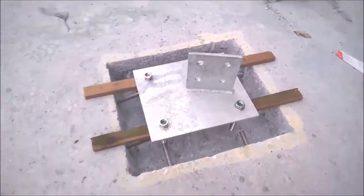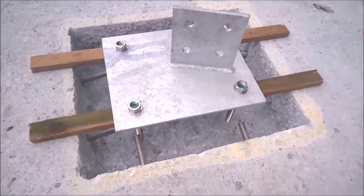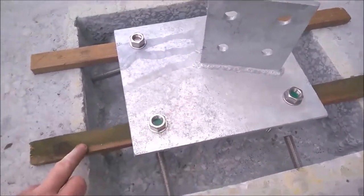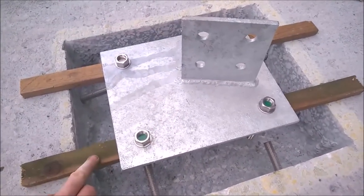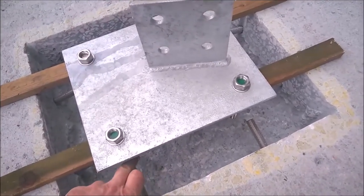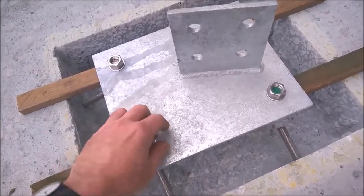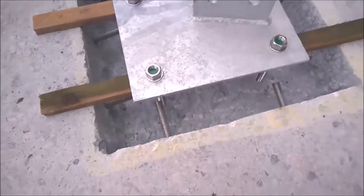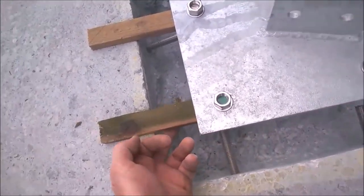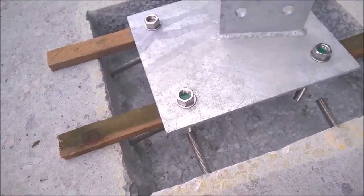Okay, so this is how I've done the foot plates around the corner on the other system. Basically, I've sat this plate on these battens here. I've drilled the holes in these battens, 20mm. The bolts, these threaded rod here, are 16mm, so I've given these a little bit of clearance, drilling a bit bigger so they move quite easily. So basically I'm going to fill the lot with concrete right to the underside of this batten here. I'm going to make it a reasonably stiff mix,